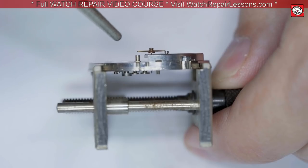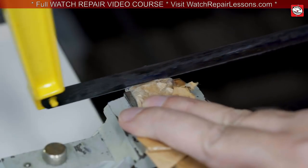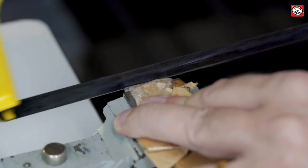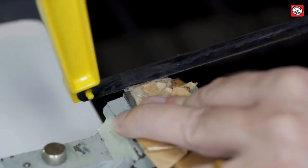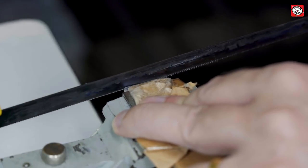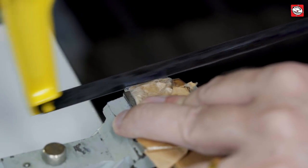But luckily, it all seems good. It's a lot straighter now, and I believe it will function well. When taking the watch apart, I noticed the minute jumper spring was corroded, and indeed, it had a hairline crack and it broke completely. These springs break very easily and have not been manufactured in decades. This unfortunately has made new old stock parts very rare, and even if they can be found, they're very expensive. I found a couple for sale, but they were over $140 each.